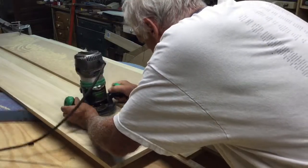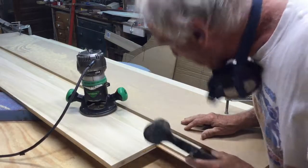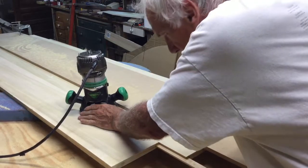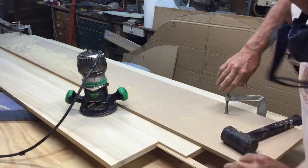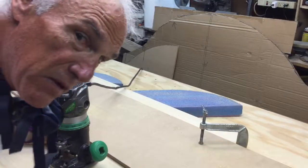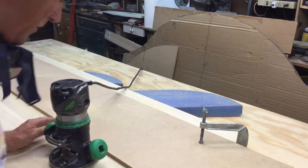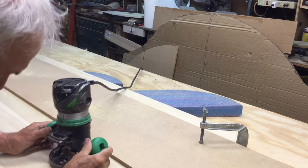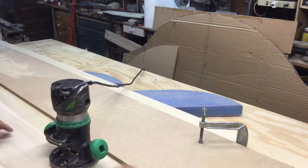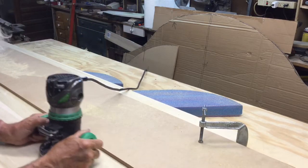There's an old show on public television out of Canada called The Router Workshop, and those guys called this their fine adjustment tool. And it really works well. A couple of quick tips. It's important to orientate the router base the same way all the time, and make sure there's no sawdust accumulated on this straight edge here, because that will affect the quality of the cut as well.